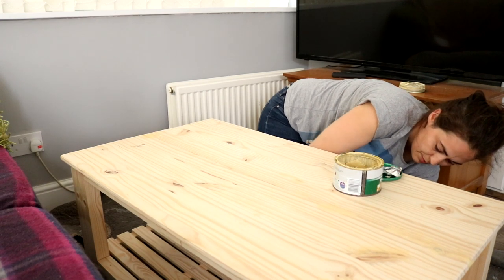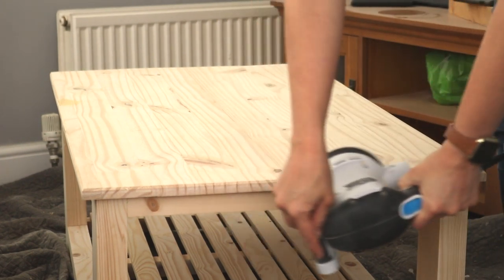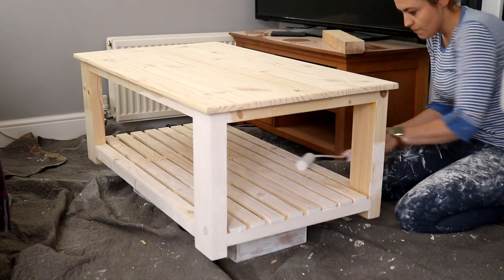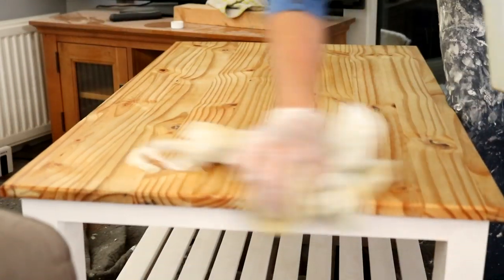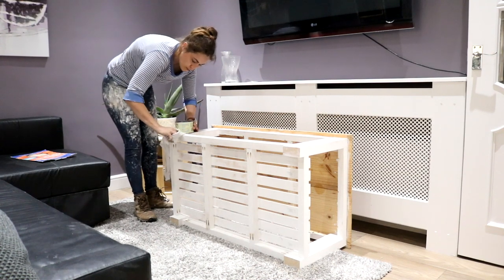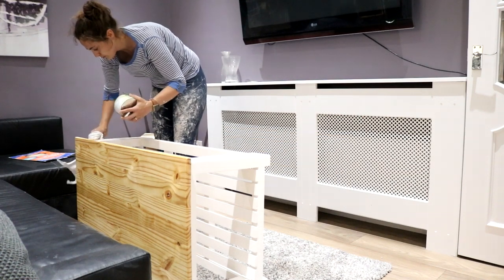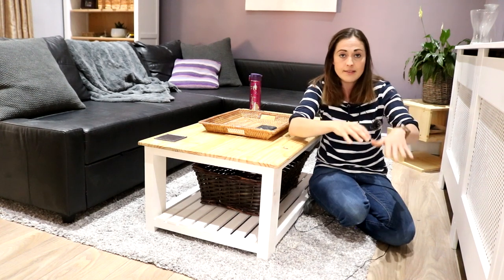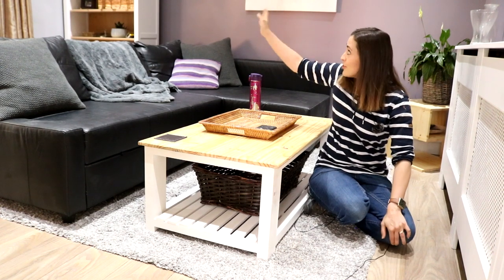I left the filler for about half an hour before sanding it all off. My intention was never to paint this at all, but a few of you online recommended painting it white, so I made my own homemade chalk paint — I'll leave a link to the recipe I always use — and went over it with a foam roller. You don't need to prime it or anything. While that was drying I oiled the top with two coats, then returned to the chalk paint and sealed it with Rustoleum's clear furniture wax. If you want to make one yourself, don't forget there's a blog post link below with free plans and free cutting lists — you don't have to register, it's just there ready for you.